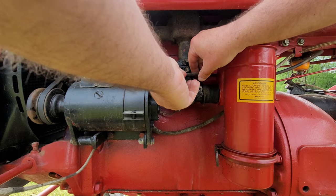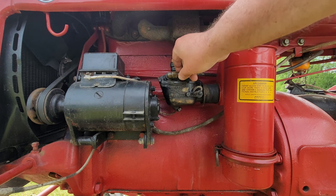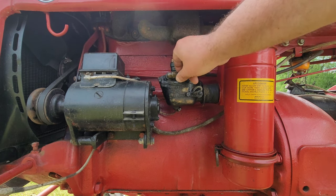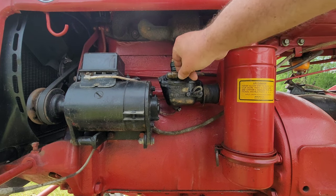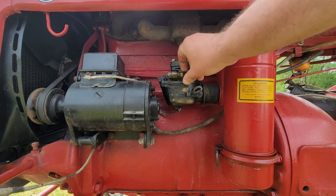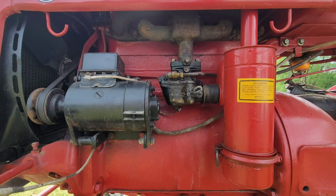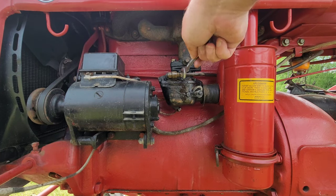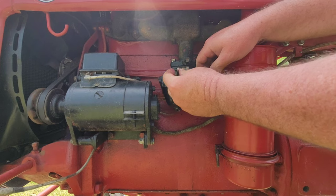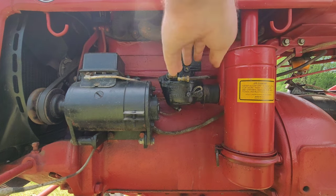All right, come on. Yeah, I couldn't believe it. I was like, okay. Took that drain plug off the bottom of the carb, not a drop. And I thought, well, the tank's probably clogged. And when I popped this line, it gushed out. So that tells you there's a screen right in there, and clogged up it should be, is my guess. All right. Boy, it's clinging on to them last couple threads there. And then I should be able to slide that right up the line. No, that's just the lock nut. So we're gonna take this elbow off of there. See what kind of present we got.